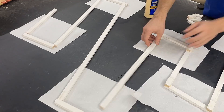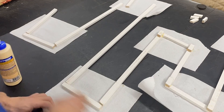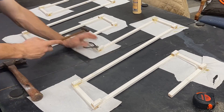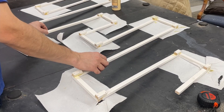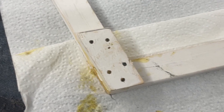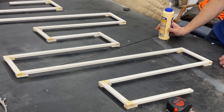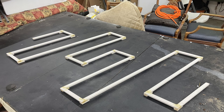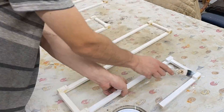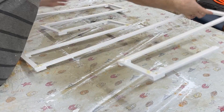As I went along, I just made sure that I was keeping an equal distance between the waves. So I put it together as best I could and didn't worry too much about it being messy because I was planning to sand and paint the whole thing anyway. Once the glue was in place, I let it sit for a bit and then went ahead with putting in the nails. I tested lifting it up to see how strong the connections were and where I needed to add more nails. Then I flipped it to the top face to get some more glue in the connections. Once everything was attached, it was time to get started with the painting. I wanted to keep this a white color, so I grabbed a can of white paint and started with the back and sides, then moved on to the front face.